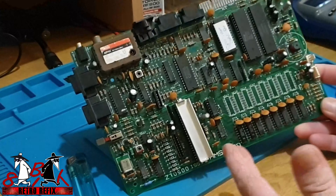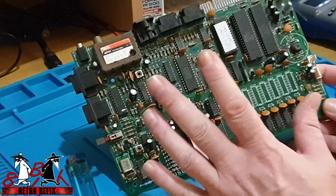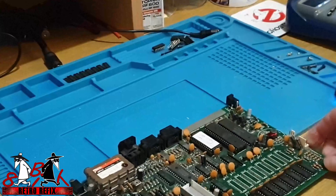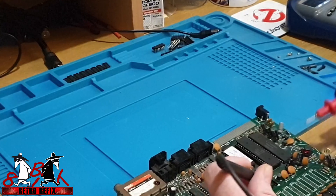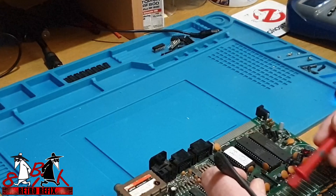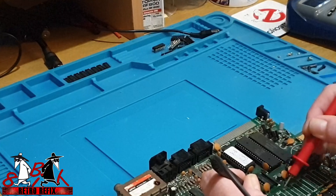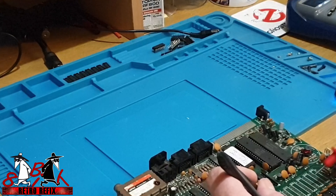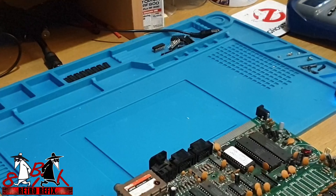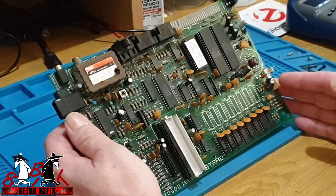What I've done at the moment - I just thought I'd try it this way first. I'm going to take the top 8 bank out, put sockets in there and put the new RAM chips in and try it again. I've done a pin-out on them to make sure the continuity is correct. If you look at the traces you can see most of them on the chips - the notch is down at the bottom, so the chips are upside down on the board. There are a couple down at the bottom that aren't linked, but I've pinned out all of them and we're all looking good.